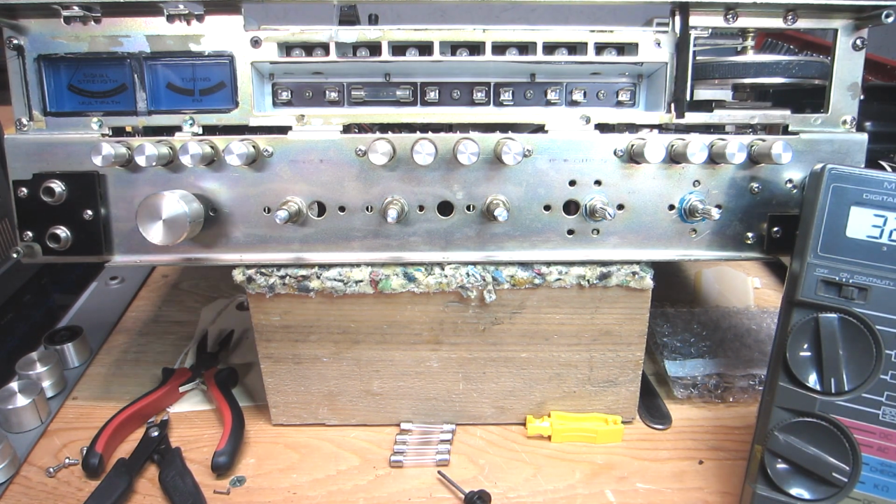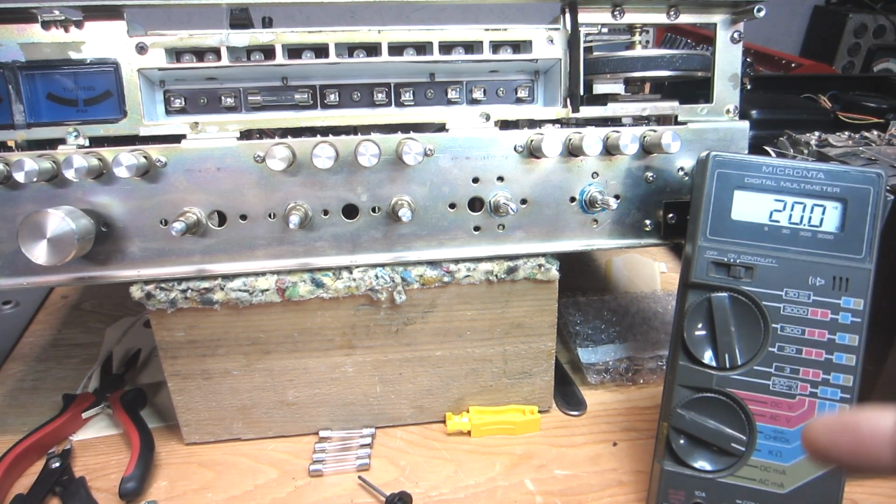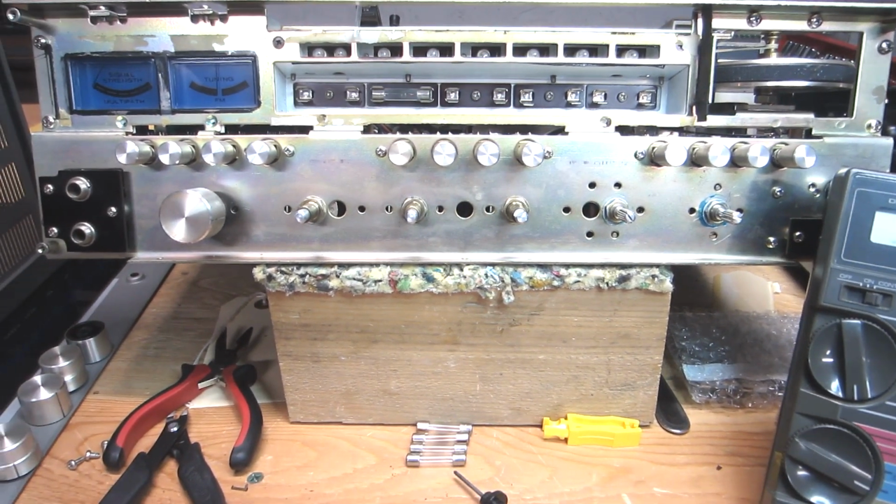So there's other possibilities, like I said, but I'm not going to get into a lot of detail. I'll just continue forward with bad lamps. In confirming that we have bad lamps versus something else, there's a couple ways to go about that. One of the easiest ways, of course, is just a quick continuity test. I'm not going to get into settings on the DMM, because they vary a little bit. Most modern DMMs have just a straightforward continuity setting.